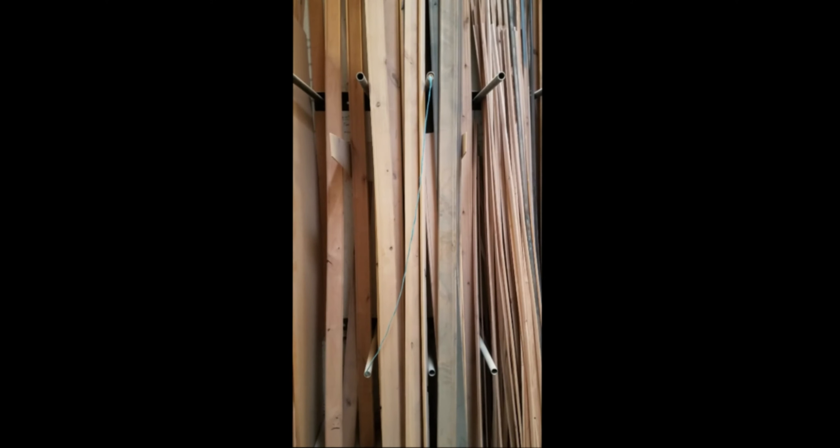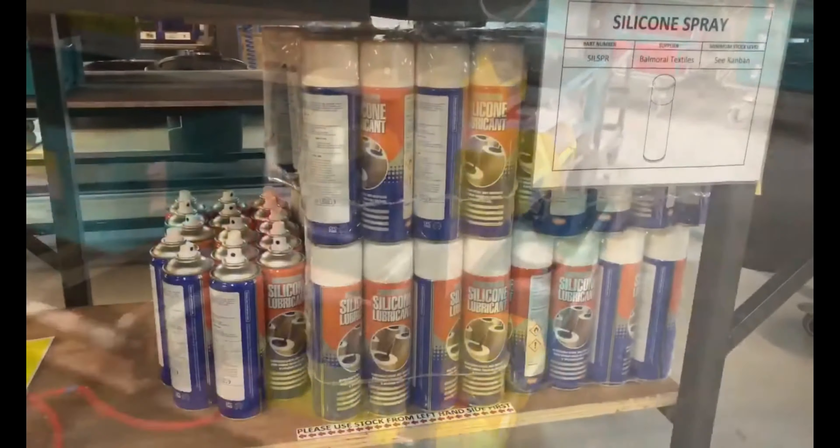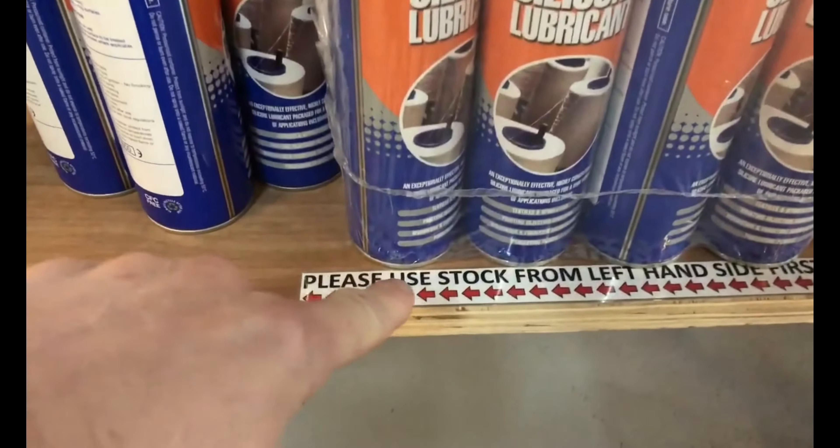Today we'd like to share an improvement that Alan from Molding made. He noticed that the MinMax Kanban system on the ramp was not working as designed. A MinMax system works by having two bins that hold the exact same material. The idea is to take material from one bin, and when it runs out it reveals a signal to cut new stock and refill the bin.